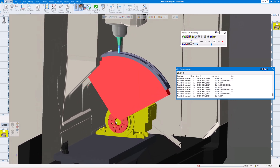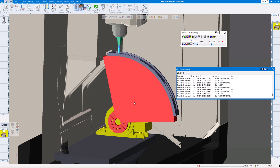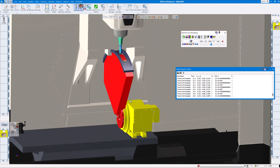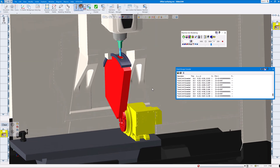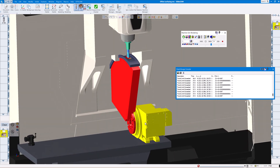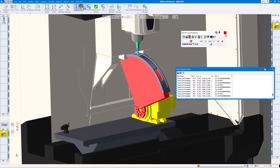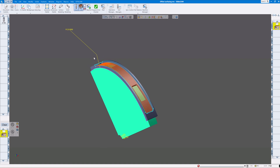Plus you're way out 23 inches from the fourth axis, so you'd have to build a pretty big fixture. And your machine isn't going to have enough travel unless you have a really tall Z and a really long Y-axis to avoid all that. So your dilemma is what do you do next?